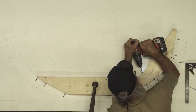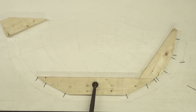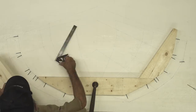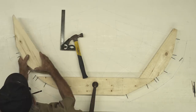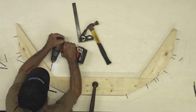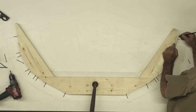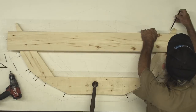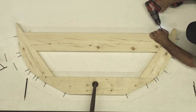The other side is going to be done exactly the same way. I'll prop the top end up with a scrap piece, get it on the line where it belongs, draw the bottom piece, cut it off just right, and fit it. Then I'll lift it up, put the sheetrock nails on the line, hold it down nice and tight — same exact procedure as the other side. Once I've got that done I transfer the bevels, cut it to bevel, check it carefully, and fasten it in position to the bottom. I tap the whole section up against the nail heads and fit it up nice and tightly. Then I transfer the planking lines onto it because that's really important information. The last step is to add a cross batten at the top, which binds the whole thing together and will also be used to line up with the other sections in the jig later on.